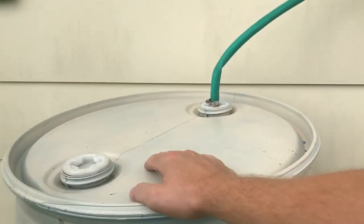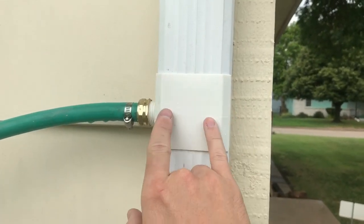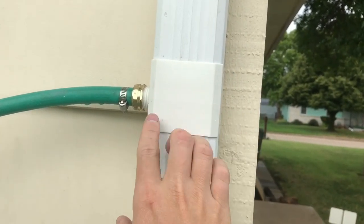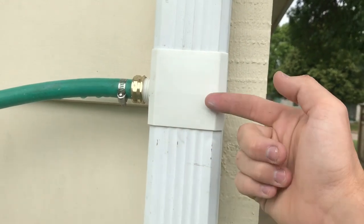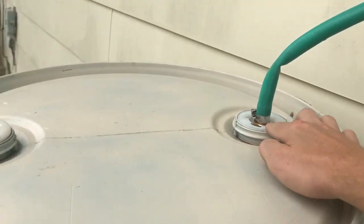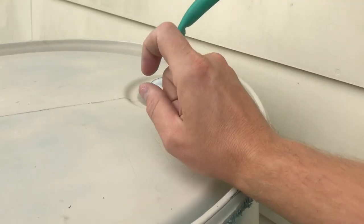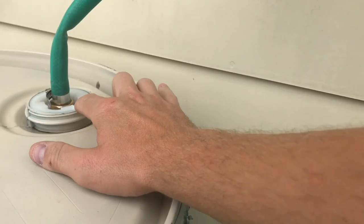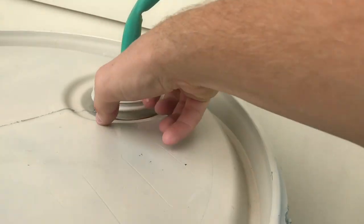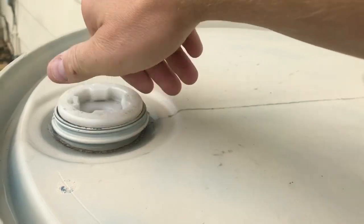I have this one right here directly off the house — it comes off the gutter into this diverter. The diverter has a little filter that filters out leaves or any major debris, and then a little cup that gathers the water and drains right into this hose and this fitting right here. This is a buttress fitting and this is an NPS fitting, which has fine threads versus coarser wider threads, so it just takes a big turn.